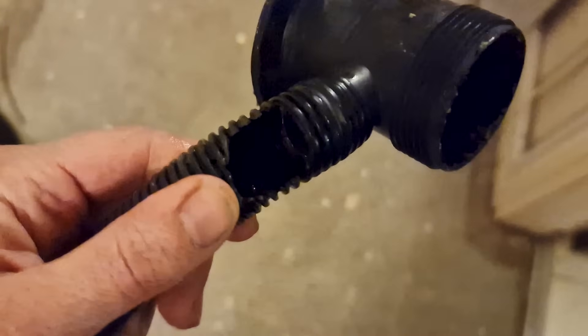I've unscrewed the bath drain and removed this bit because that's the bit leaking — there's a massive hole, it's the size of my thumb. I think the overflow hole was caused by a mouse gnawing through it. I'm going to patch this just in case because it's exposed now and I want to go to bed — then tomorrow I can get a piece and replace it properly, maybe not the bath panel though.